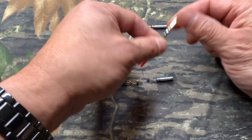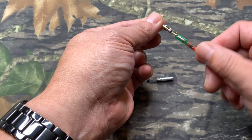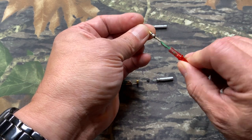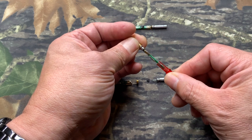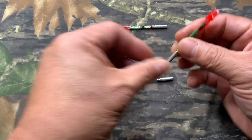In most cases, turning it clockwise will tear the wire off the circuit board. So always counterclockwise. When you clockwise it, instead of anything binding, you cause the wire to break — you can see how it turns and binds right here. So always counterclockwise when you turn the circuit board.